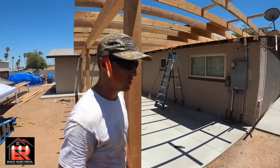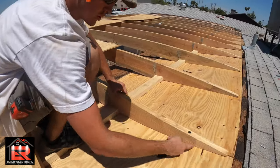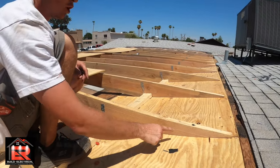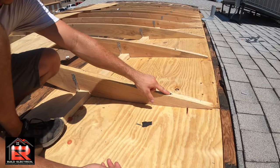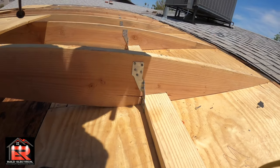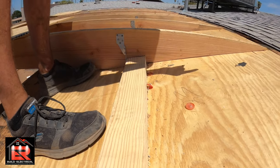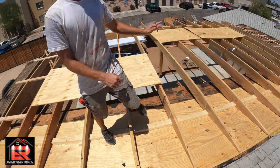Here's our rafter connection up on the roof. You can see the rafter has good surface area and every rafter is lined up with a truss so the weight distributes right into the truss without relying on the plywood. We're using four-to-five-inch structural lag screws — pre-drill then screw in. Over here we have a typical hurricane tie, and it's notched right here. The two-by-four is also lag screwed and locked in place — hurricane tied and lag screwed, 100% solid.